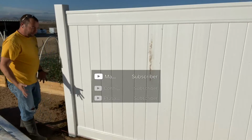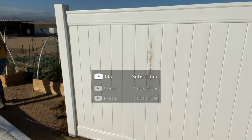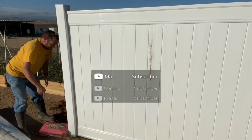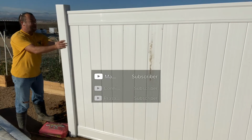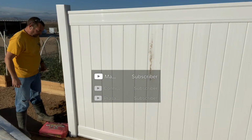So I'm gonna go and get my water over here and get a bag of concrete. All right. And I will say, you can use many different kinds of concrete. I like to use the fast setting stuff. It's in a red bag, at least at Lowe's. I'm sure it's at the other stores. But this stuff you don't have to pre-mix. You can put it in the post hole dry and then add water to the post hole. That's how I've done our whole fencing here. We'll show you in a minute after this one's set. And it's worked great, so no issues.